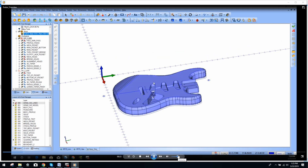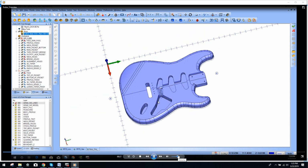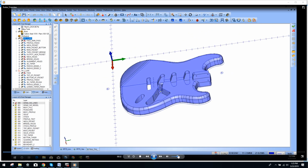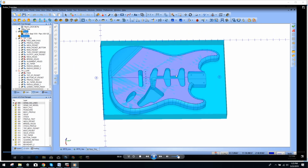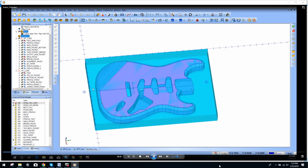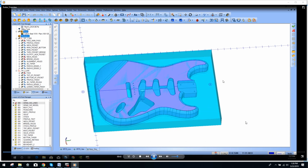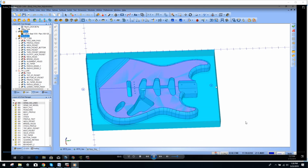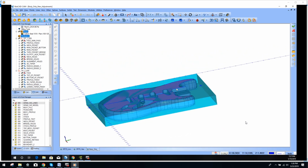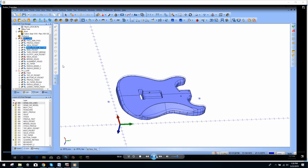Another part to show off, to show you what we're able to do and the kind of things that we're working with. This part is going to start out with just a solid piece of wood, of course. Roughly, I believe I have that as 14 by 23 or so. Maybe a little longer, because I know we ended up changing these two circles you see right here. Those are pinholes, and you can really put them wherever, but that'll get done on op 1, and that'll be what we use when we flip it over to orient the part properly on op 2.